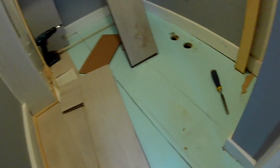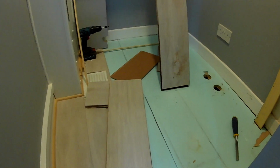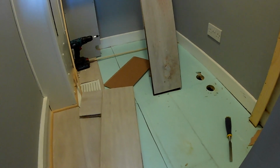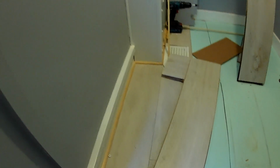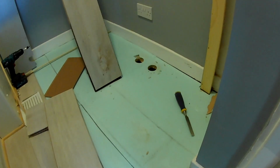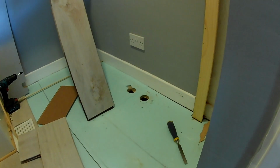Let's see, the 9 panels, so yeah, so they've got 2 packs here, so it should be right, because you need to cut the ends. You need the tongue for the end, you see. You've got to waste the whole board. You use either end, one for either side, so it can clip in. Then you cover it with your little strip, or you just put it under the skirting or put it to the skirting, but some people will put the skirting on top of it. I prefer to use that because, as you see, I've had to take the skirting off. It wouldn't be that easy to come up, so you're probably a wee bit better using the edging strip. And that's how easy that was.